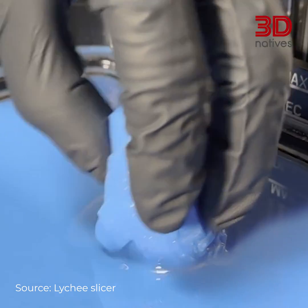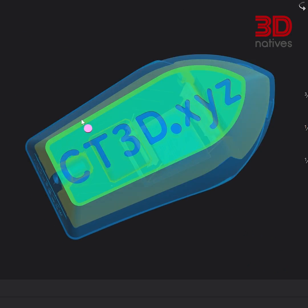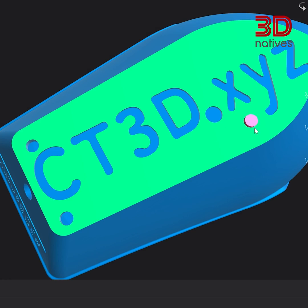Here's another potential headache: cupping. This happens when a hollow or convex area on your model acts like a suction cup during printing. To avoid this nasty surprise, consider adjusting your model orientation to minimize cupping. Your slicing software may also have tools to identify areas prone to cupping, allowing you to add drainage holes to prevent those vacuum forces from wreaking havoc.